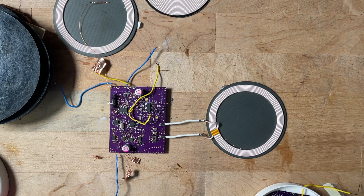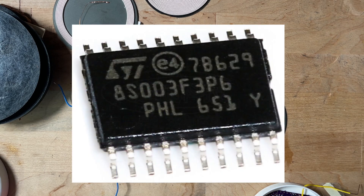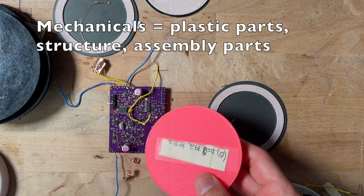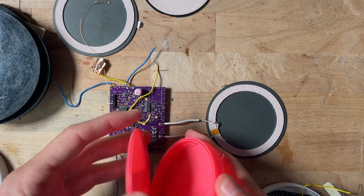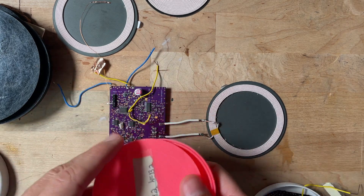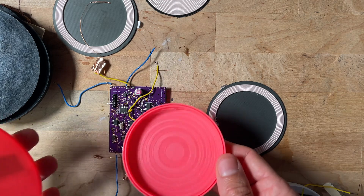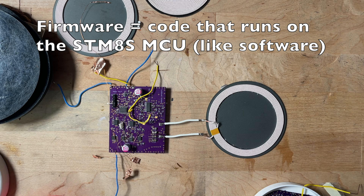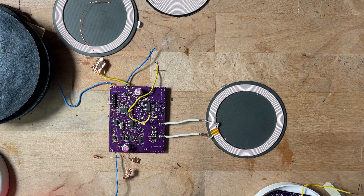At the pre-proto stage you choose your MCU — a microcontroller. I like STMicro because I've worked with them in the past. I chose the cheapest microcontroller I could find, which is the STM8. I started building mechanicals, experimenting with different diameters and how this would come together, iterating on that. Then you figure out how to write the firmware, moving the design closer to a manufacturable, workable product.